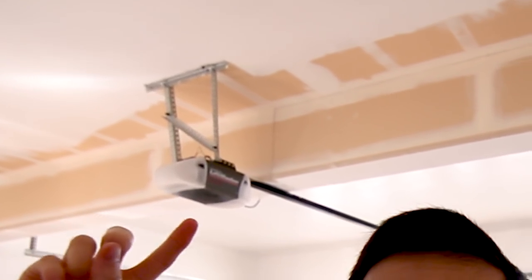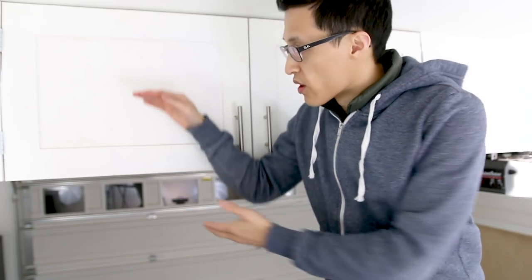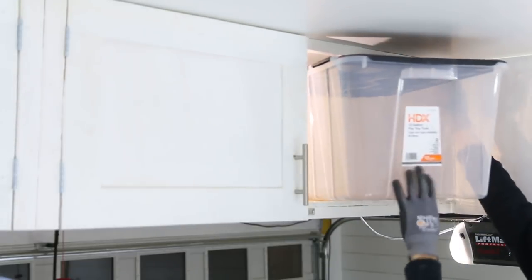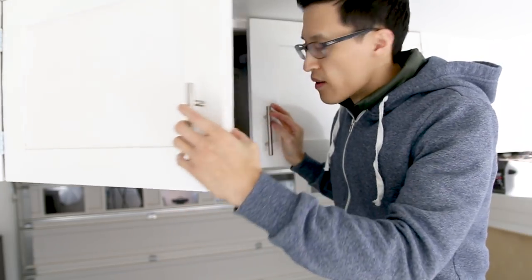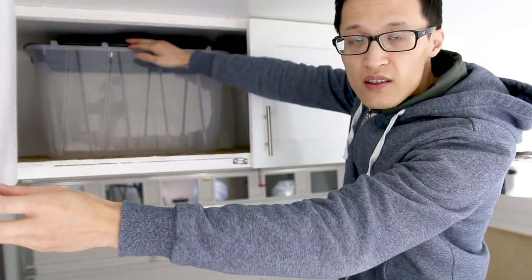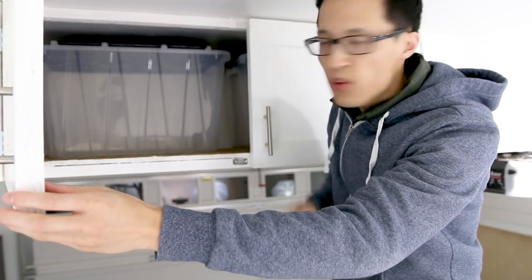I was also able to hide my garage opener supports — metal beams coming out of the ceiling holding the garage opener — and I enclosed those into the storage unit as well. That gave me about 16.5 inches of height to work with. You need to find storage containers that fit that space, and if you account for the framing and the shelving, your storage container can only be about 13 to 14 inches in height. This storage container here is about 13 inches and it fits perfectly.